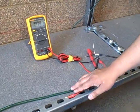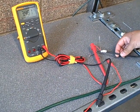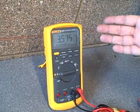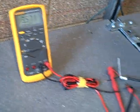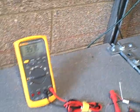What we have here is a demonstration using an extension cord plugged into a common voltage from the wall, and we're also using a two-wire shielded cable. With this, we have it connected to our Fluke Voltmeter. Currently we're showing single-ended voltage here at 3.5 volts AC — that's between one of those conductors and earth ground. And that's a lot of noise voltage.